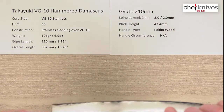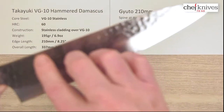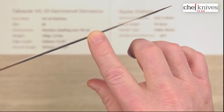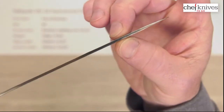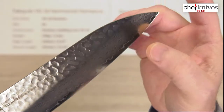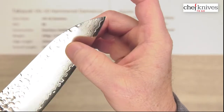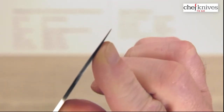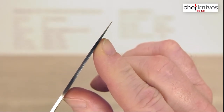Thickness on this particular one is about 2mm. It's a little hard to measure sometimes because you've got the dimples right by the spine, but you can see it pretty much just maintains that thickness all the way through. There's not really anything in the way of what we call distal taper where the blade thins out. Where it does get thinner is as the knife gets ground down towards the edge — easy to see where the layers are — and then it starts to thin out towards the tip. They don't have these tips super skinny, so there's a little more meat behind them.